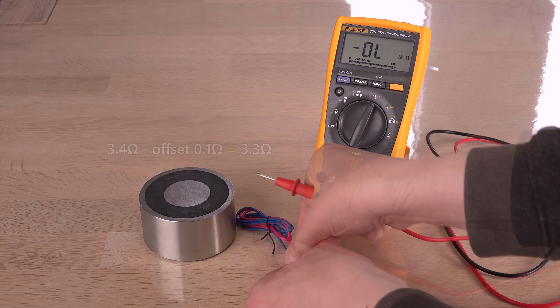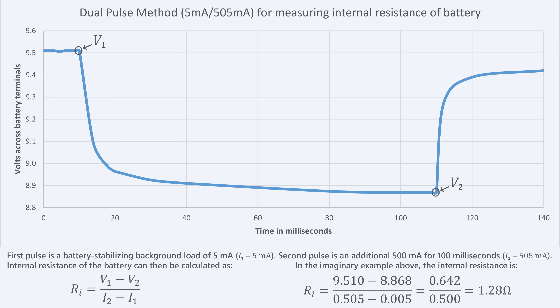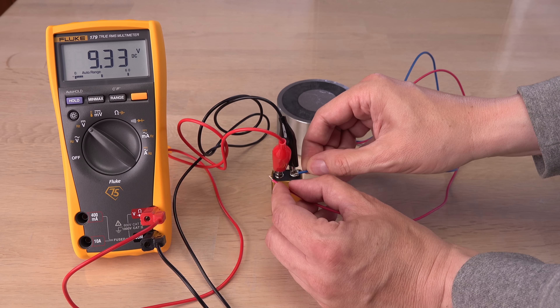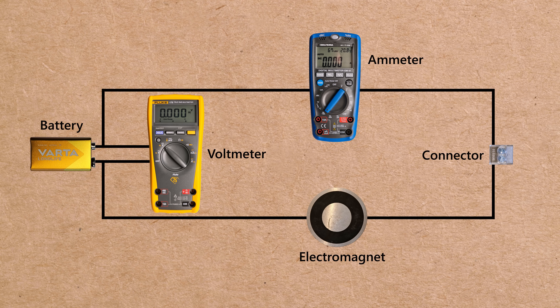The resistance is 3.3 ohms for the permanent electromagnet. In reality, I should use an oscilloscope, since a more official way of measuring internal resistance is with the short dual-pulse method and using the voltage drop from shortly after the steep drop. But I don't have an oscilloscope yet. In my more in-practice multimeter setup, the used VARTA seems to have an internal resistance of around 4.3 ohms, and the fresh discount battery is around 3.5 ohms. Internal resistance increases the more an alkaline battery is discharged, so it makes sense the used VARTA is a little higher — but they both still have quite high resistance.